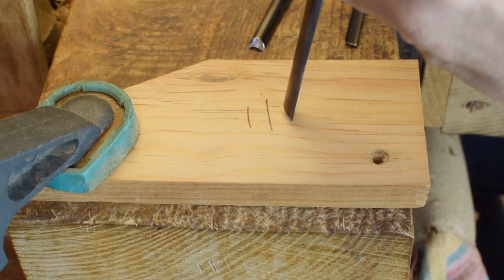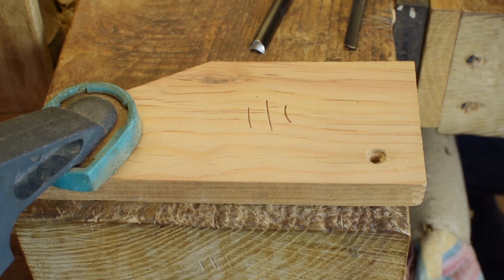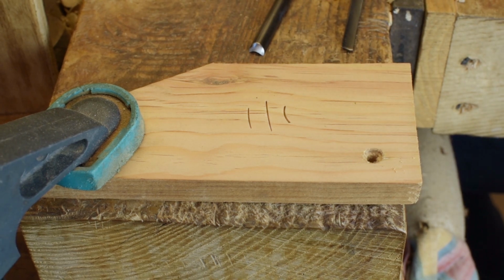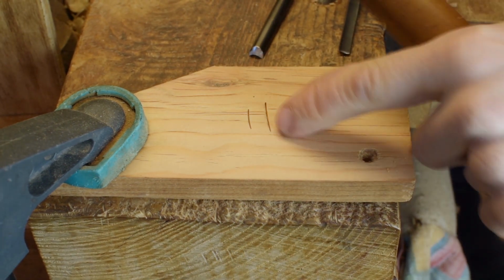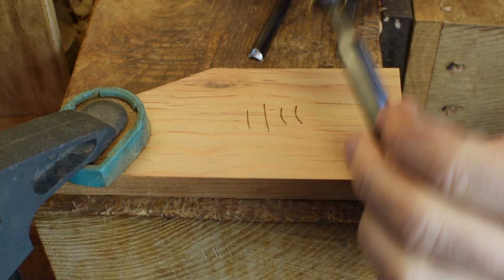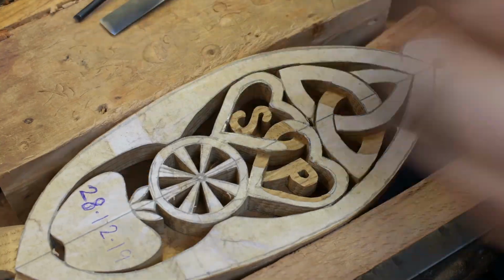Another gouge then that I like is that one there. That's another Herring Brothers, and that's a lovely one. I find that's good for doing the bowl. The one that Dad was referring to for doing the bowl is slightly more of a sweep on it, but again, that one I think is an old Marples, and that's a lovely one for carving out your bowl.